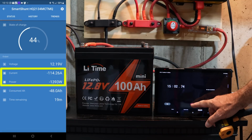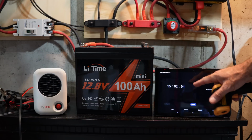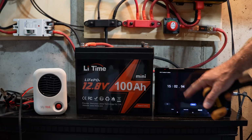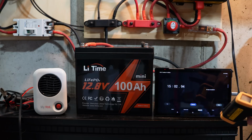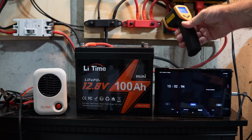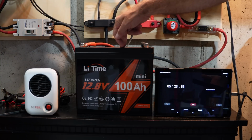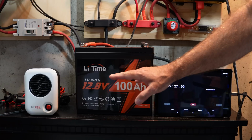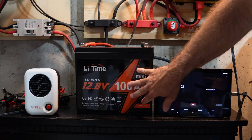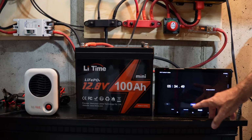All right. As you can see, no problems running this thing for a full 15 minutes at basically 12 to 14% over its rated continuous discharge capacity of 100 amps. So not only does it output at a very high capacity, significantly exceeding that 1280 watt-hour capacity number in my capacity test, but it is also performing very, very well in load testing.